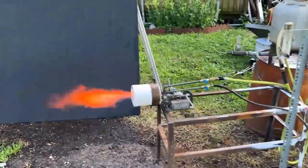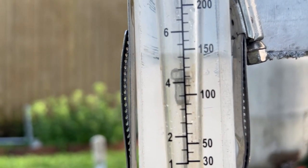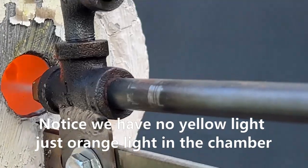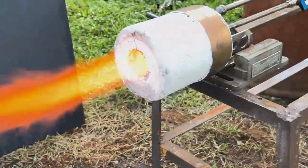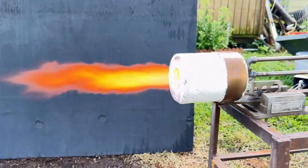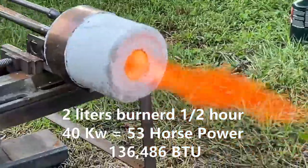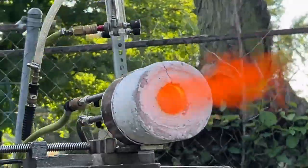What that does is it turns the burner into an air horn — or what other people may know as an ejector, which is a type of air pump. You can see here we're capping out at right around 4.25 cubic feet per minute, just under 5 CFM. I know it can do more than this. Unfortunately this camera is not capturing the true essence of the flame — it looks a lot better than that. Right now we're stuck at around 53 horsepower and I know we can do more.